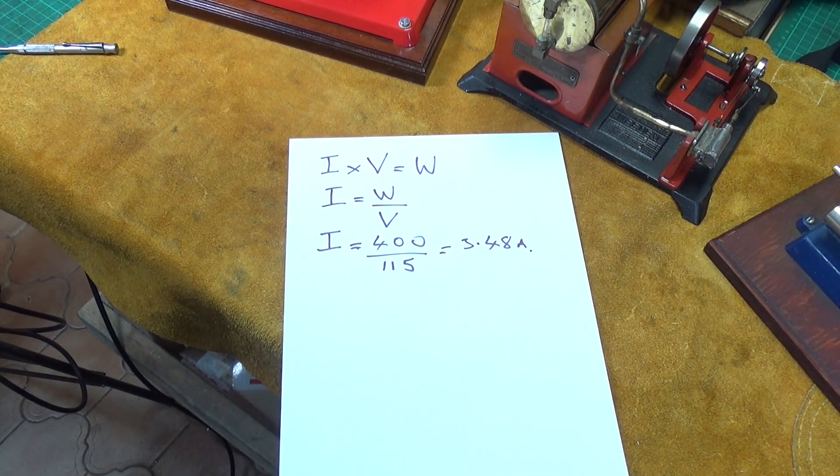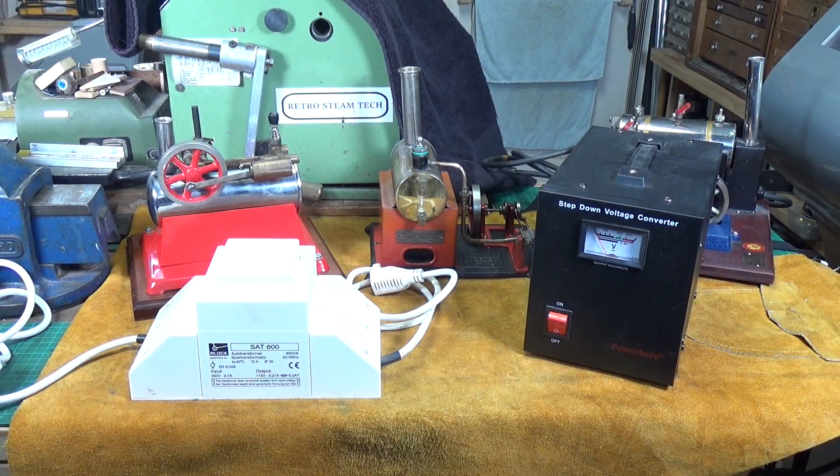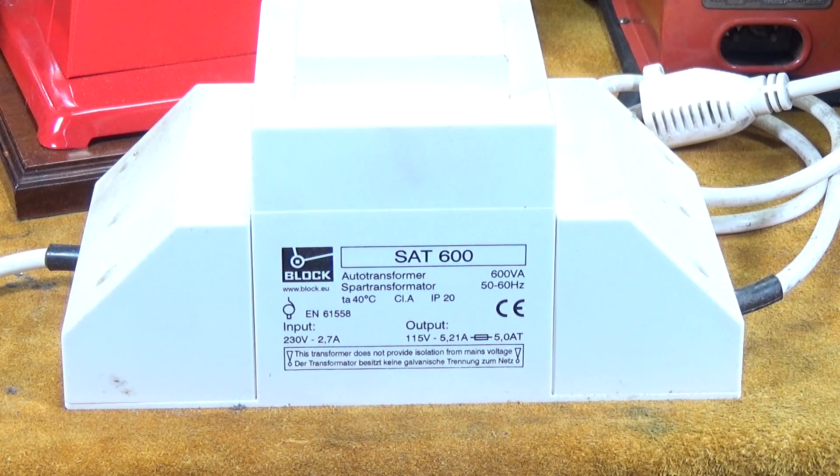That's useful for two specific reasons. The first reason is so you can work out whether your power supply is capable of providing the power needed for the heating element. You don't need to worry about this if you live in the United States where the mains voltage is correct for these engines, but I live in the UK and we use 240 volt mains, so I need to step it down to 115 volts. Normally step-down transformers will give you 120 volts - you're in the right ballpark. You need a meaty step-down transformer - a little wall-wart type simply won't do.